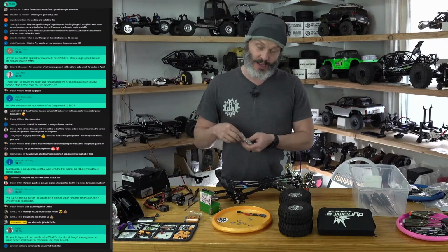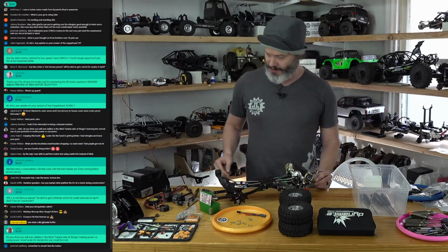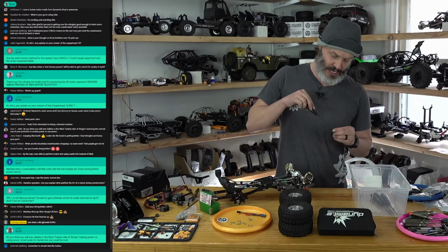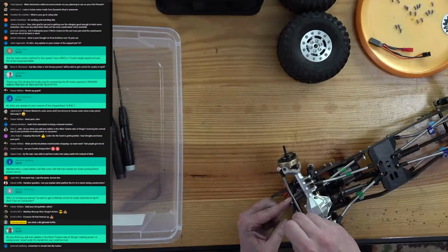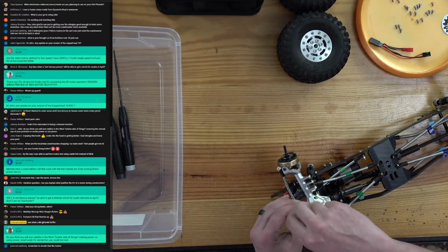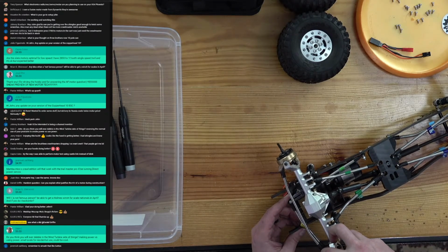So theoretically, like I said, everybody uses different test methods and different test equipment. There is technically a way to get your proper kV. Like I told you, you spin it up and then you use a secondary motor to increase its RPM until your amp draw of that particular motor is 0, and then you will have your idealized kV of that motor. Okay, next question.